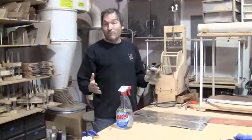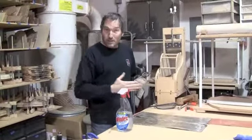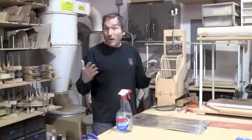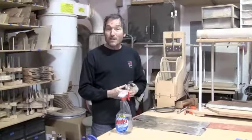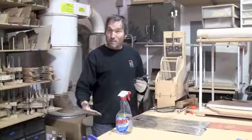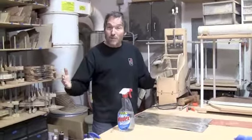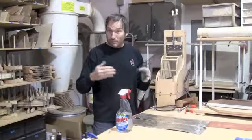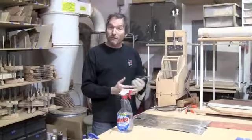And for me, it's a reinforcement of the way that we at Mya-Moe build, which is in a continuous process. And we're lucky we have enough space that we can do that, but there's a huge advantage to it. And that is that every day we bend a set of sides. So when something changes, we know right away, not after a batch of sides, but after just one. And we can figure out what went wrong in the process, what has changed, and fix that.